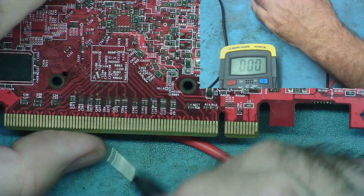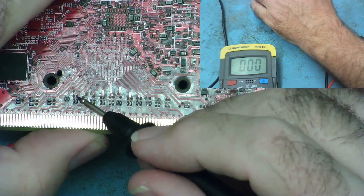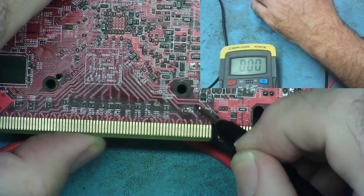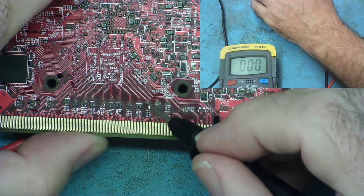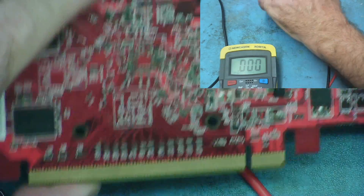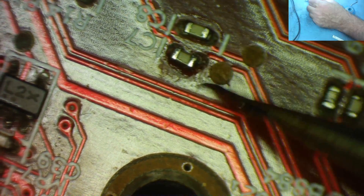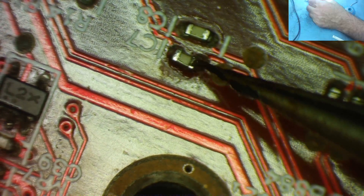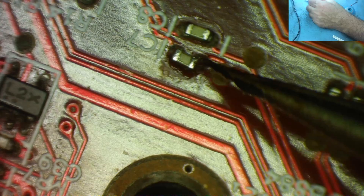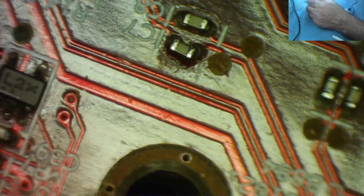The question now is, with this card, if I replace these two capacitors C7 and C14 which the eagle-eyed subscribers spotted, will this work? I've soldered C7 back in - it's slightly crooked but we can test it. We can test from this end to the finger and measure in diode mode from here to ground and here to ground. If they read the same, we know it's connecting to the GPU.